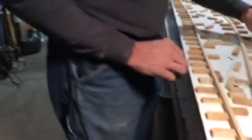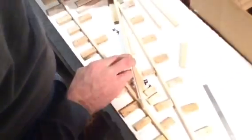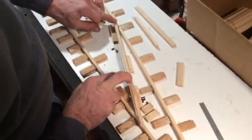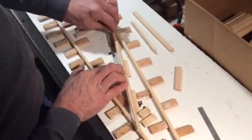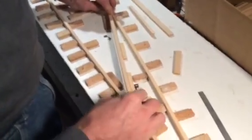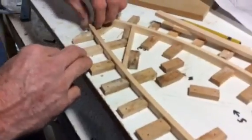We came back and placed our locating pieces for our internal bracing, then went ahead and cut the internal bracing pieces to the correct dimensions, laid them in there, and did the same thing again with our little blocks. As you can see in the box here, we have already pre-cut in bundles all of the internal pieces for all of the ribs we're going to be building — we just did that ahead of time to save time at the saw. So here we come and lay out our internal pieces just like you see right here.